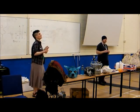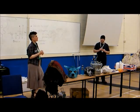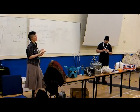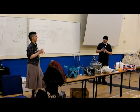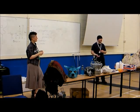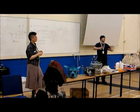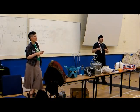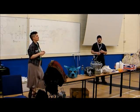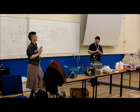It's basically damp. But when you're casting from that, the problem is if you let it dry out completely, it'll start to crack and fall apart. So you actually have to make the cast when it's sort of leathery. And you also have to seal it with a gloss varnish or something like that, spray varnish. Purely because that gives you a seal over the clay and will keep quite a lot of the humidity. It's possible to make a mould from that without sealing, but you wouldn't want to do that for anything that's going to be a surface.